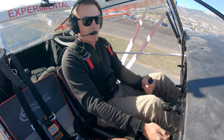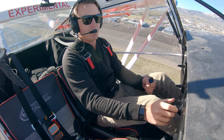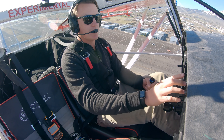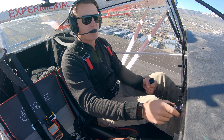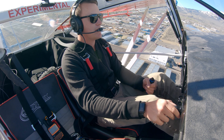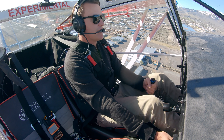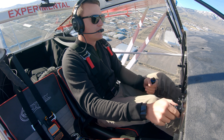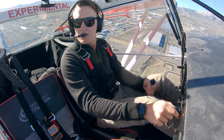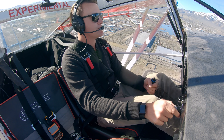I'm making a little less manifold pressure than I was making down in Idaho — not sure why that would be. 45–46 inches, right at shy of 5,800 RPM, climbing out at 70 miles an hour, and it keeps wanting to go faster. We're just over 1,500 feet a minute.